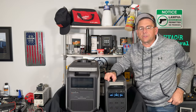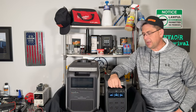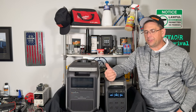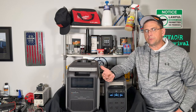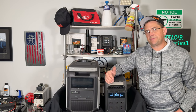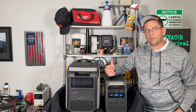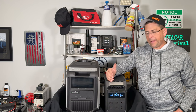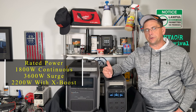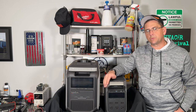Having bigger isn't always better. This at 1,800 watts of continuous power is going to be able to power anything you'd normally plug into a traditional home outlet. Now, the Delta III does feature XBoost technology, which is made more or less for hair dryers and resistive loads that aren't really critical on voltage. What it does is actually lower the voltage output, which then lowers your wattage, so you're able to handle loads up to about 2,300 watts. XBoost mode is not really good for computers — resistive loads is where you want to use it the most.